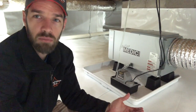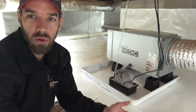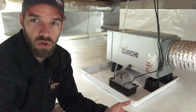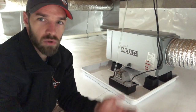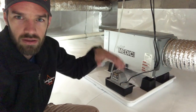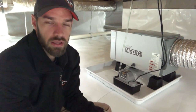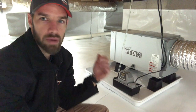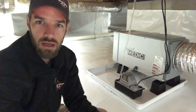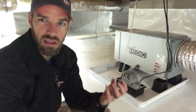The reason we don't do that is one of the main reasons I've seen plenty of people try the whole downward slope thing to the sump pump or wherever they want to drain. Usually the reason it doesn't work is that the slope isn't downward the whole way — they'll put it in PVC pipe and it does this wavy thing, and you're getting some uphills that the water's trying to travel through, and that's going to back up the system, back up into the dehumidifier, and you're going to have issues. Whenever you have that backup in the line, you get a lot of bacteria and stuff that builds up in the system too.